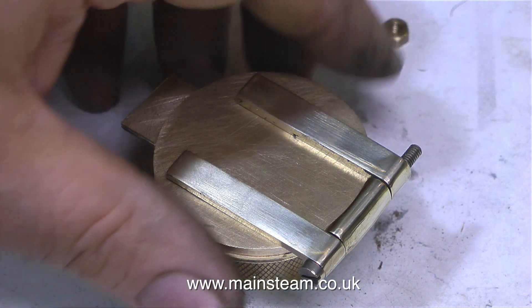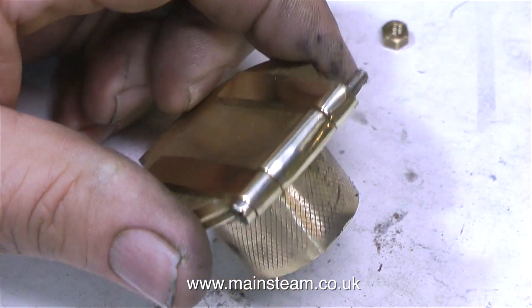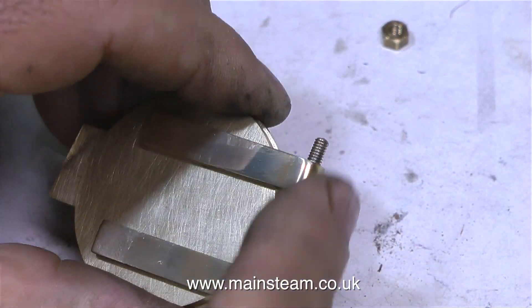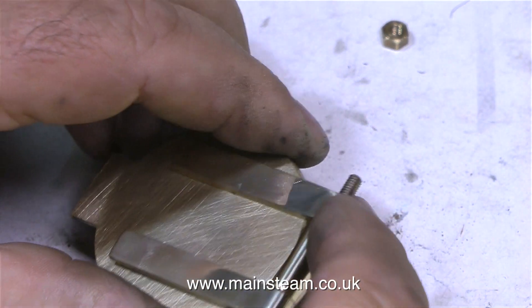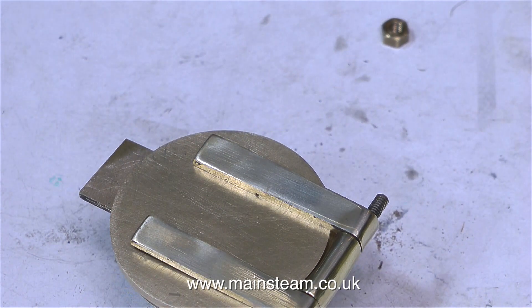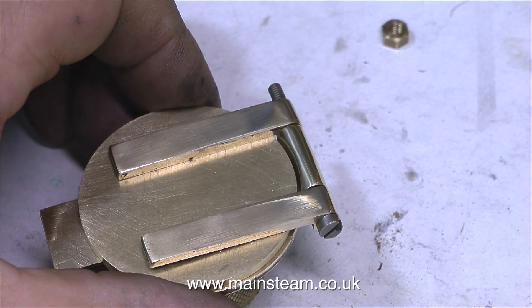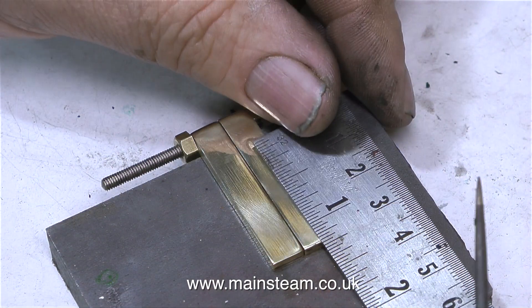That's why I didn't bother with the previous set of hinges — they were too narrow, the ends were not shaped correctly, and the drilling of the holes was poor. I just drilled them by eye on the scribe marks and made a thorough mess of it. I'll take this opportunity to thank the viewers who wrote in to tell me how to do it properly. I just wanted to illustrate something I see all the time: fire hole door hinges are often drilled freehand, the holes are just not in the right place, and it looks terrible.